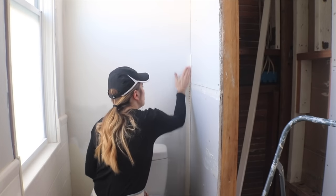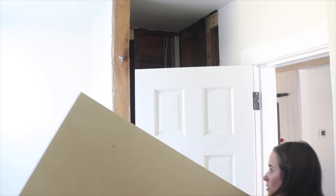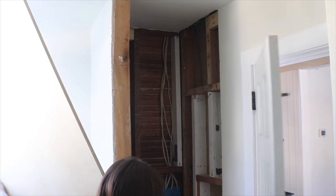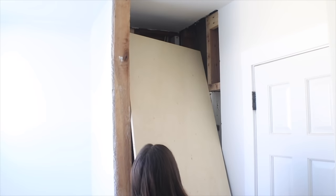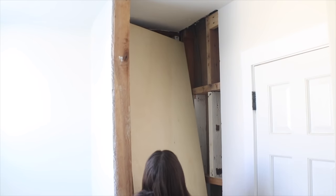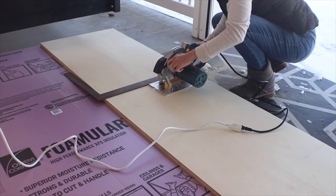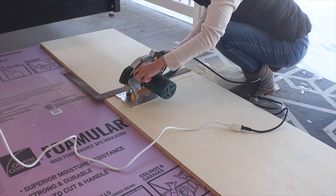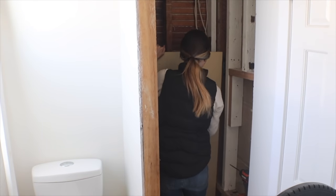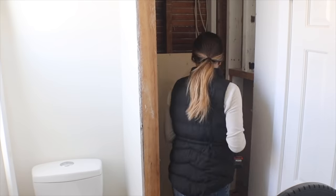For the actual inside of the closet it's not going to get drywall — it's going to get plywood. At first I tried to maneuver one large piece of three-quarter-inch-thick plywood cut to size into the back of the closet, but it was such a tight fit that I figured out there was no way it was going to happen. Working in a house that's 130 years old, none of the walls are square. So I ended up cutting the back piece in two pieces, and I lined up the seam where the shelf is going to go so the seam can be hidden behind the shelf board.